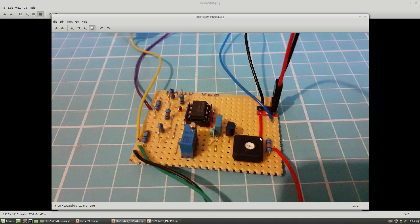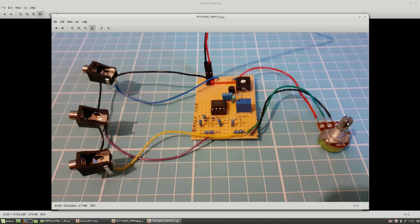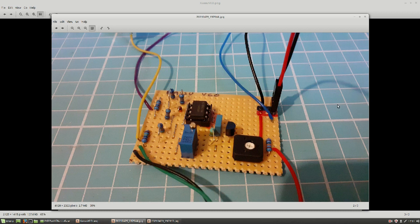The trim pot sets the lowest frequency — I turn the potentiometer to its lowest setting and use this trim pot to tune it to the lowest note I want it to play, which sets the bottom of the range for the VCO. Then connected to something with a one-volt-per-octave output — I use a Keystep for this — I play a scale and then use this multi-turn 1k trim pot, the CV tracking trimmer, and just keep trimming until the scale plays in tune. That's it, it's pretty much set up.